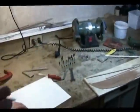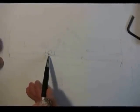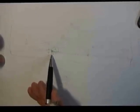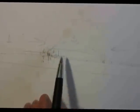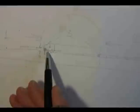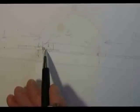He's just explaining, if you can get in on here, Ivan, that this distance here between the raised plank and the other plank, he in Ambasio, I think he only allowed a small distance. I don't know what it was. I'll ask him. Then the deck started to curve up in summer because the deck was breathing. These planks were expanding, and it caused them to all compress. So he took it all apart and gave it a larger distance, which solved the problem. So the idea is to leave a bit of a gap so that planks can breathe.